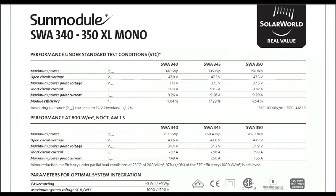The same charge controller can handle 800 watts of panels in 24-volt mode, and in 48-volt mode it will accept up to 1,600 watts of panels. You can see quickly why investing in a quality charge controller and running it at 48 volts rather than 12 volts allows you to put a lot more panels on that one charge controller.